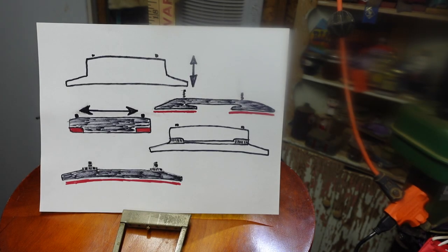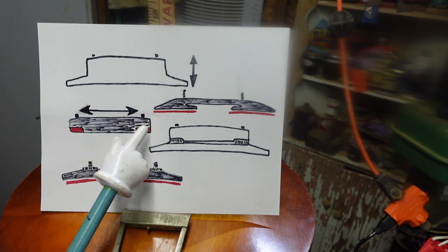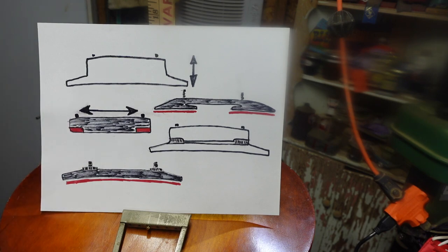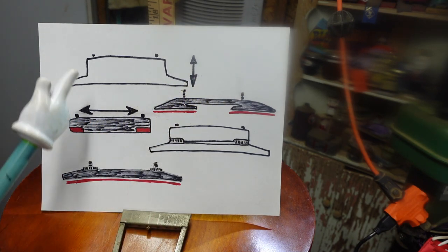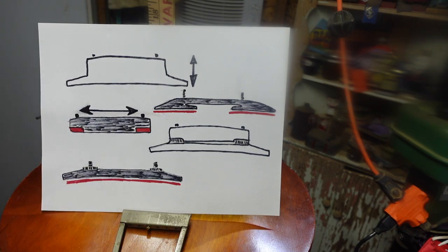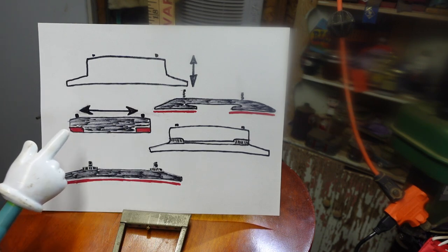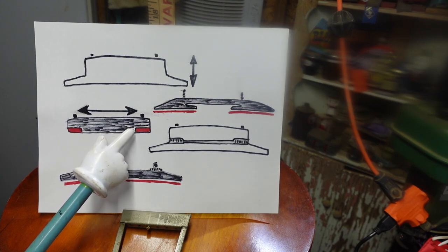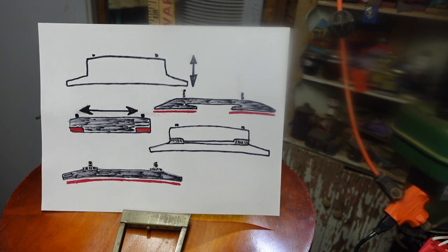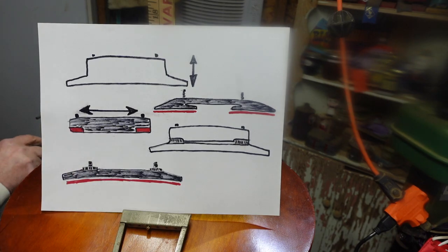When you're going to cut down this top piece and you need to make that notch, don't go all the way to the corner — get fairly close and then take a very small round file and file to round that corner off. Instead of making it a 90-degree corner, you want to protect the grain both ways. If you cut this line and extend up to here, and then bring this line just past that one a little bit, as soon as everything starts working against each other you're going to have a split.